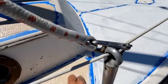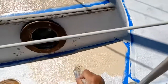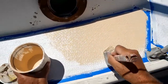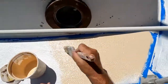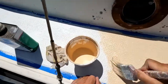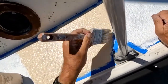The bow area there I just primed this morning, so we'll have to wait till tomorrow. There's a 16-hour setup window that they prefer you to observe, so it's not like we don't have something else going on here. I don't want the paint on too thick either, because that covers up the non-skid, which I kind of need.